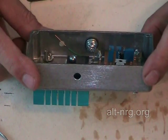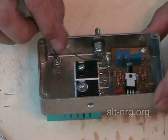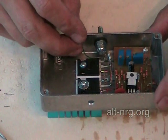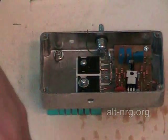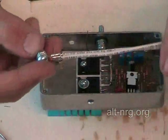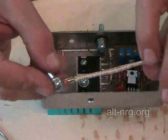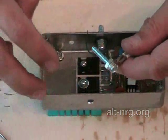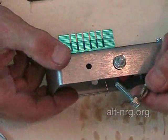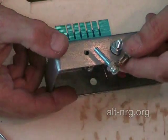Alright, I think we're ready for R12. I'm going to take my wire that is the ground reference at the ground side of R12, just bend it straight up a little bit, and here is my double R12. This incidentally is not insulated from the case, so the hole drilled in the case is just large enough to fit the screw. I don't need to worry about a fiber washer on this one.